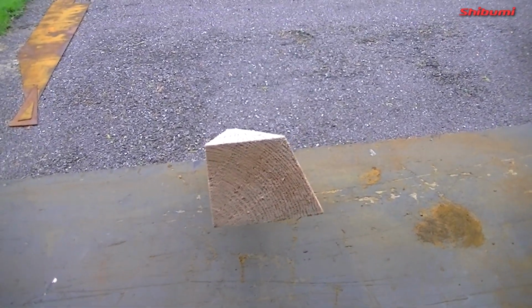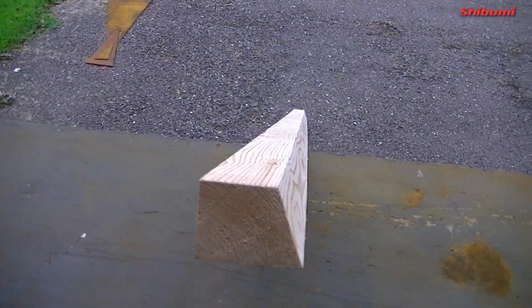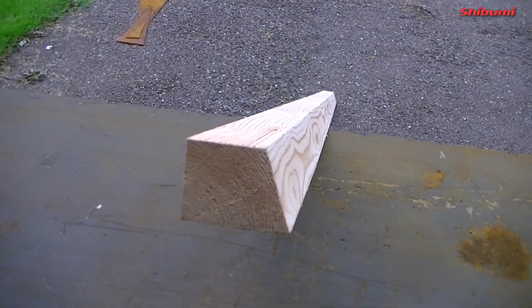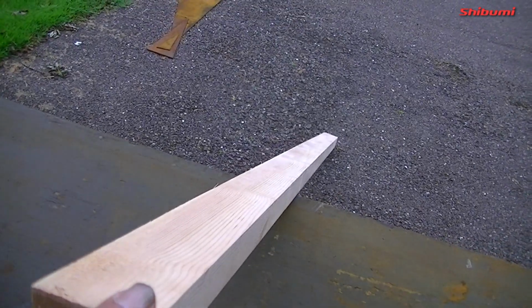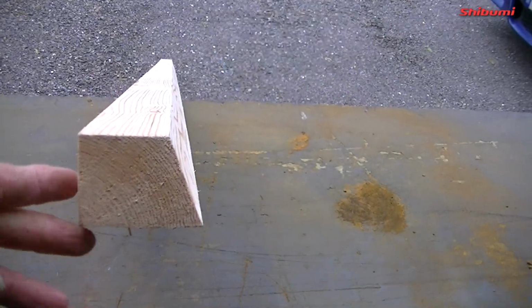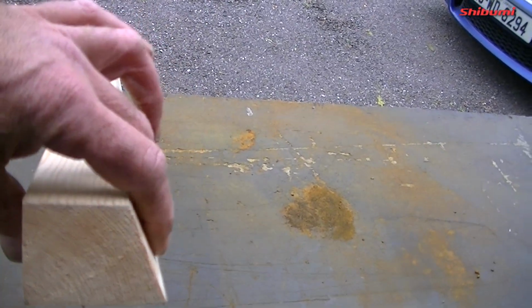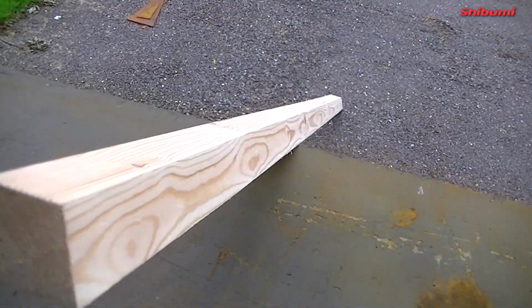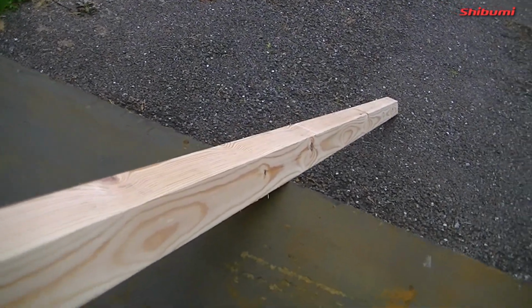So that is exactly 113 degrees, and what I did is I went to my ex-neighbour, ex-school friend and owner of Waterford Joinery, Sean McGrath, and he cut me this piece off a wasted piece of door frame that he had, and we measured it down to 113 degrees. So basically I'll clamp one piece here and one piece here and get my tacks going, and that'll stop it from deforming, and I'll be able to make my 2.5 meter long pieces of that weird angle iron, and that'll support the back of the tank.